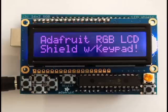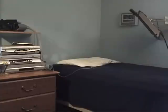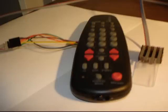For a display unit, how about this? That should be familiar to all of you. Originally I was going to wire the micro-switches in parallel with the five push-buttons on the shield, but then I would have had to drape the wires from the top of the TV, across my chest, and down to my right hand. Instead, I came up with another system where I essentially have a remote-control remote-control. I took a simpler remote and wired just four switches into it — I even put in a jack in case I wanted to try different switch configurations. Essentially, I push the micro-switch, which sends a signal to the Arduino. The Arduino uses it to move the cursor around on the display, and then the Arduino sends the proper signal back to my TV or my cable box.